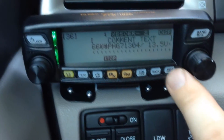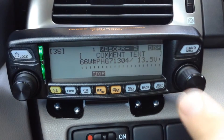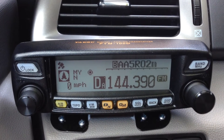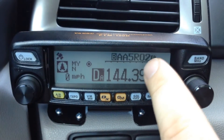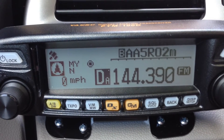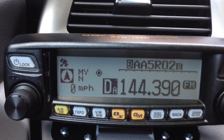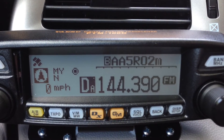Let's hit display — there's the station list. We're getting WB5OER coming in. Let me hit display again. I hit something earlier and got the station list. We're getting a nice long one, and like I said it goes back and checks VFO B so you can still be monitoring VFO B and transmitting APRS at the same time — you'll just hear the packets. It does have a mute option. It's KN5D-12 and looks like it's an igate because it showed the igate symbol at the top.